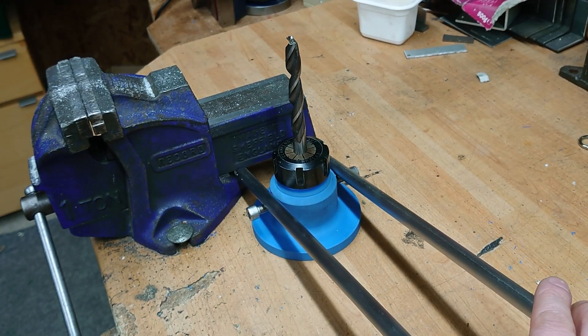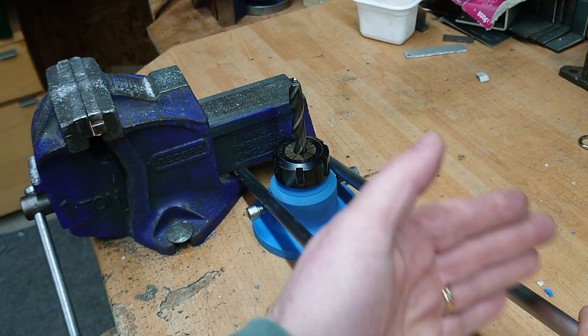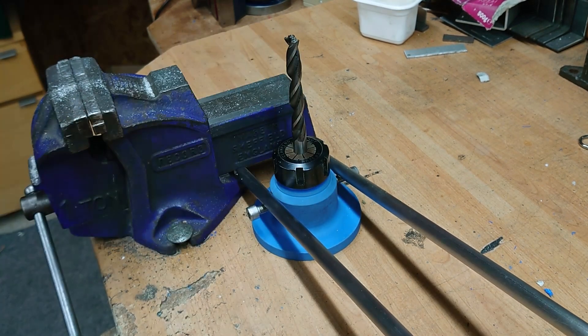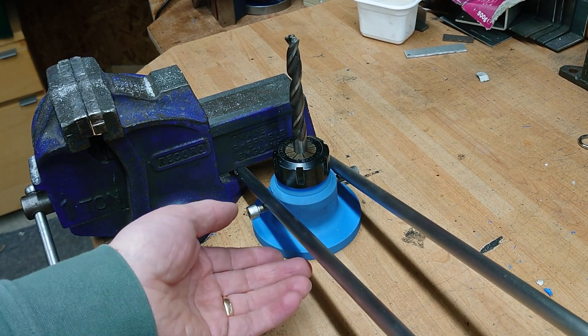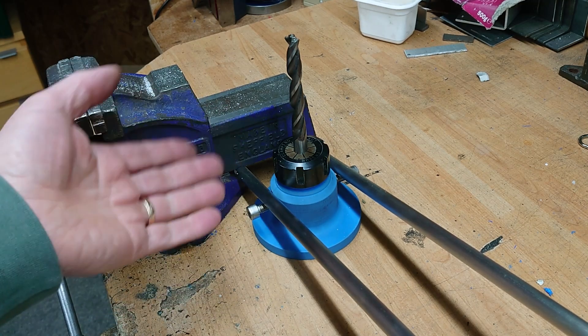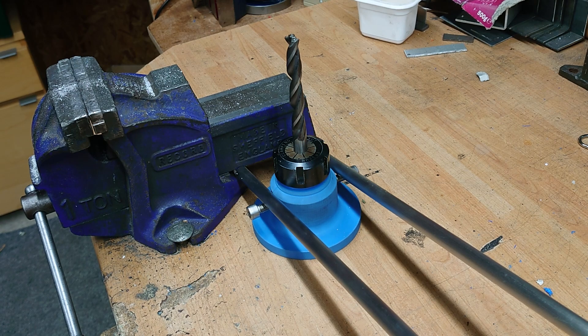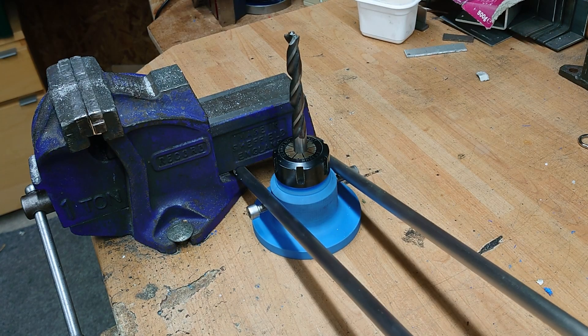So in order to make it a comfortable amount of force to apply to release the action, I need at least a foot — I think probably more like 40 centimetres, which makes it another 30% easier. So it's going to need a reasonably long handle and a fairly stout mounting for the pivot of the handle back here to stop it bending. Probably not every lathe is ideal for this because that's a fair bit of force, but the type of lathe I've got with taper roller bearings front and back shouldn't be an issue.